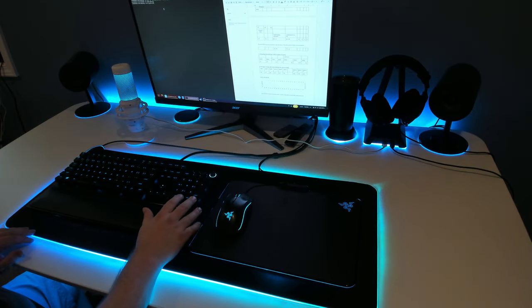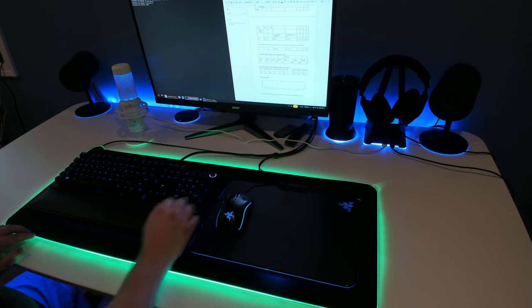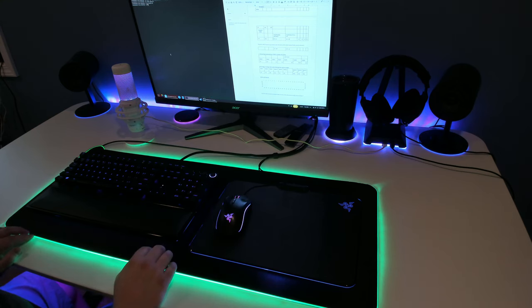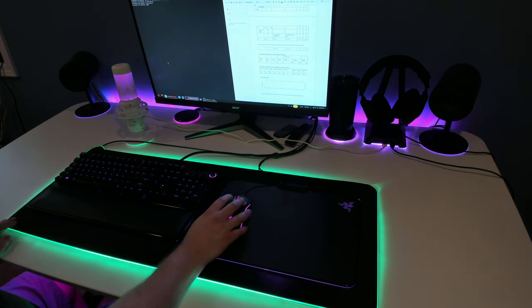So ready, set. That's green. That's not red. Okay. It is possible that they messed up on their documentation and they just got the byte order wrong. And realistically, that's not that big of a deal. It could be GRB instead of RGB. And I mean,